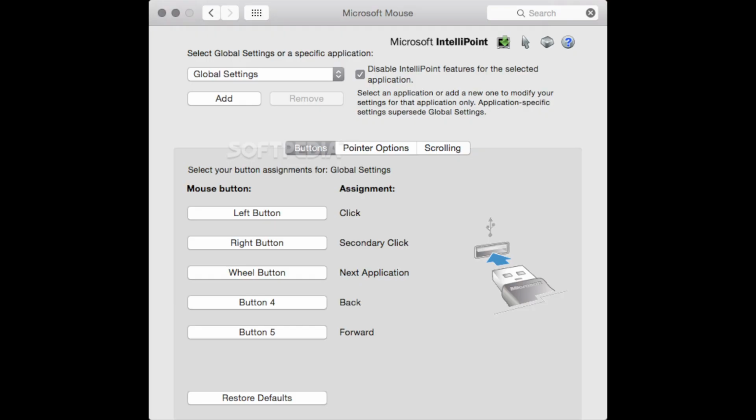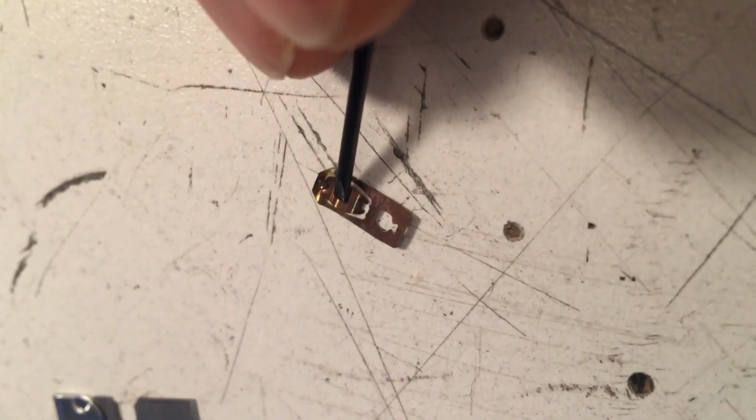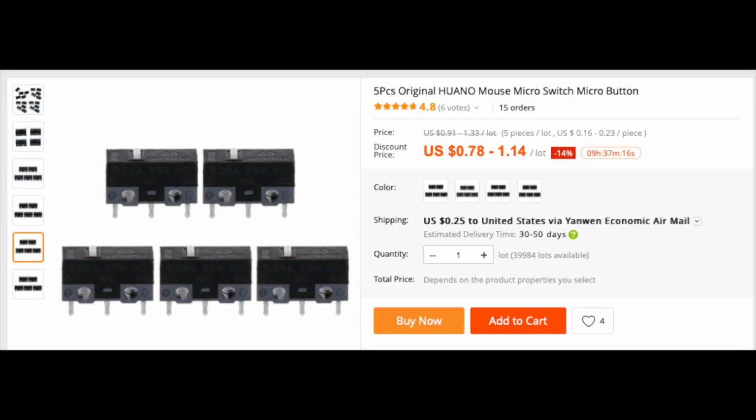I mean, if you're going to cripple your gaming mouse, you might as well just use a high-life office mouse or something like that. You could take it apart and clean them up and lubricate them with something like Fader Lube or Deoxit, and then retension the return springs so that it's going to make better contact. That'll help for a little bit, as long as you don't ruin the switch when you're taking it apart. Or you could go ahead and try the Japanese Omrons and see how they work out for you. They're not that expensive. Or gasp, horror of all horrors, try a different brand of switch. Maybe one that doesn't use the 2-spring design of the Japanese switches, but does use a rivet on it that's going to give you better electrical contact at micro loads.